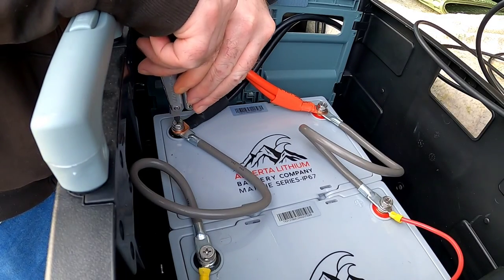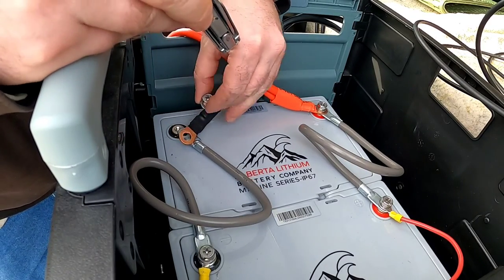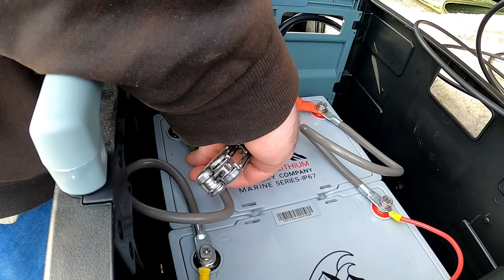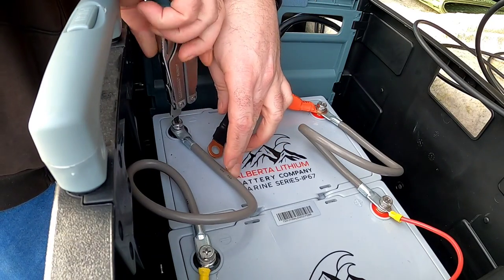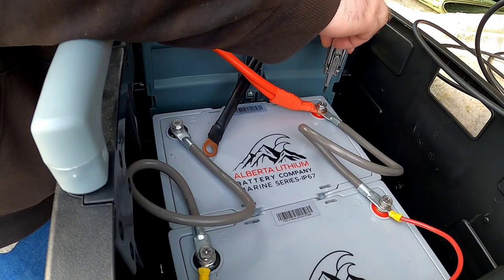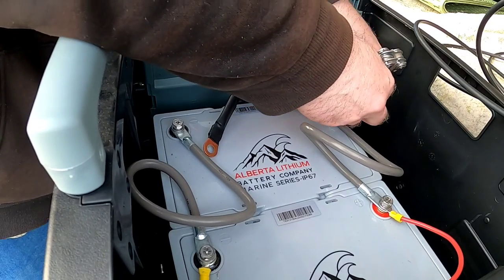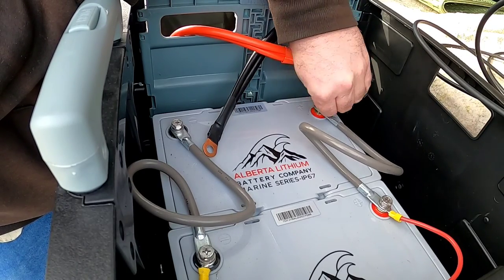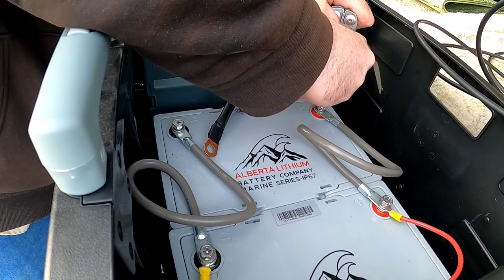As I'm packing up, I just thought I'd add an additional comment. That beep was the sound of the inverter losing charge because I popped off the negative terminal — which was expected. Now the capacitors inside the inverter are still fully charged, so I'll pop off the positive and make sure the positive and negative terminals don't touch each other. I want to talk about safely packing these things up when going mobile again.